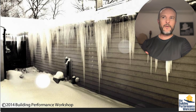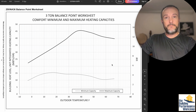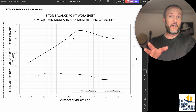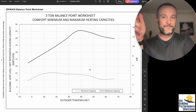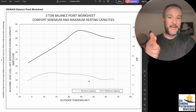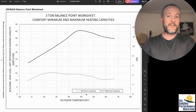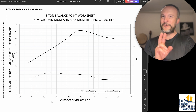What I want to show you is some charts. This is from the Carrier Infinity — a top American brand, their top-of-the-line heat pump, variable capacity. This unit does not have what we'd call hyperheat. Hyperheat is the ability to pull heat out of air that's very cold, down to zero Fahrenheit or even negative five. AHRI is the organization that rates these units and gives you the sticker showing efficiency and heat output. We measure the AHRI standard at 47 degrees and also at 17 degrees, because those are very different numbers.